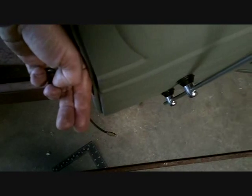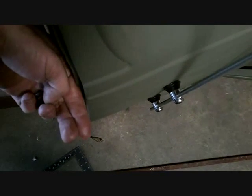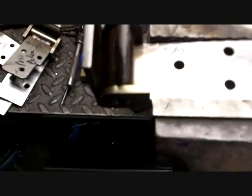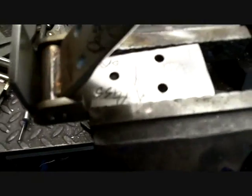They have to be like this, not like this. With them like this, I can't get them close enough. But when you do this, they suck in, and I got just enough gap in here. I can always shim it if it's too much, but I can't take away from the gap unless I bend these. These puppies are so tight. There is no side load. And we got bronze bushings on the bottom. You can just barely see in there.